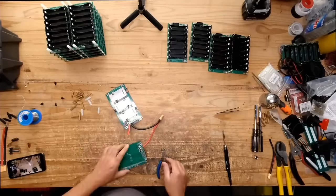So these are two battery packs, right? I'm not gonna plug those on there, but basically, those are gonna be plugged in there. These are gonna be plugged over here. But it's two battery packs. This is a 24 volt battery pack: 7 boards plus one BMS, and 7 boards plus one BMS. Those are connected in series. That's what we did, this little thing here. And then this is a 48 volt output cable, right?